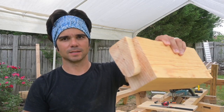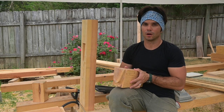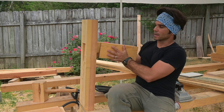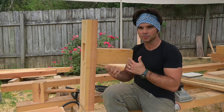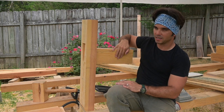This is a sliding tapered dovetail tenon, and it was made using this jig. This is the connection that you're going to see in a lot of the commercial online timber frame kits. It's just going to be this dovetail that slides in and locks in. So this is another option to have in your tool chest. This is a pretty good connection for a post and beam connection.